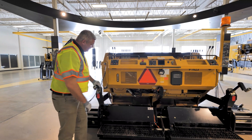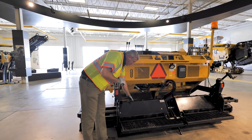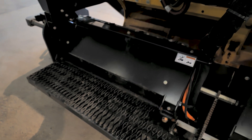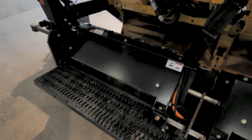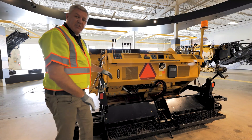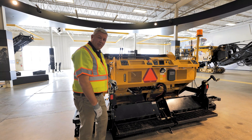Standing back here, you're going to have two panels, left and right. We're going to pull these panels down on the outside edge of each side. You're going to have a similar bar that's going to control your slope of your extender. We're going to want to make sure we go in there and get those zerks also.